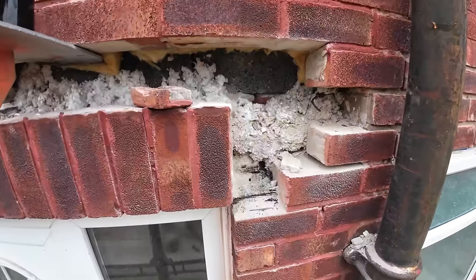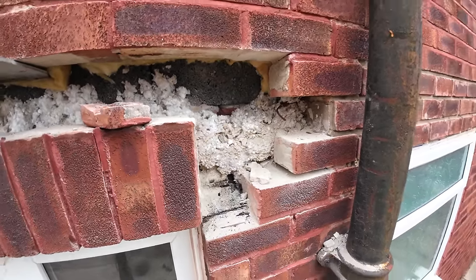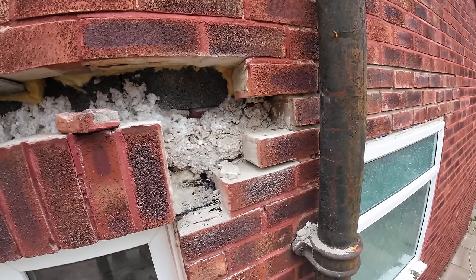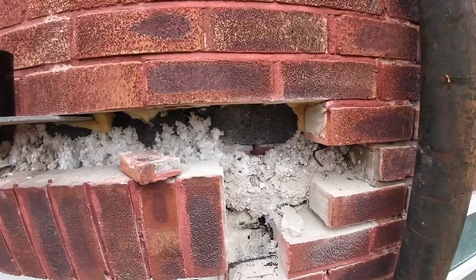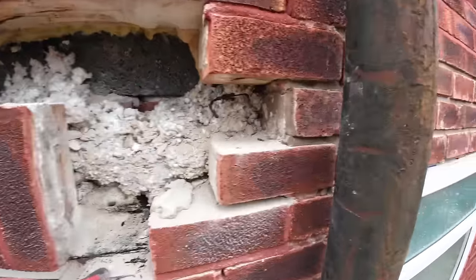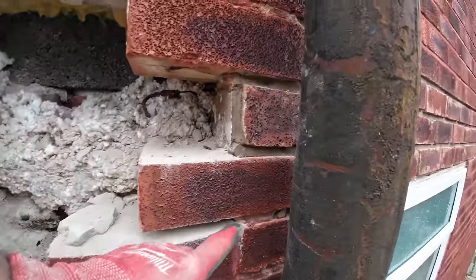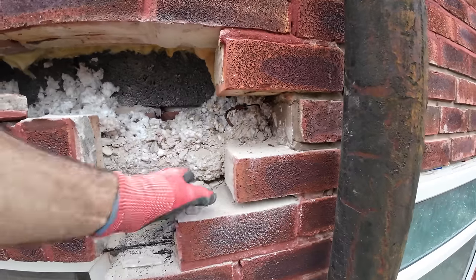So it's a good job we brought two spare bricks, Alex. Yeah. One of those is a three-quarter. They've been cleaned. Leave them up here. I know where they belong in. They've got to go back in the same place. Okay. So there you go. Lintels, of course, low in the window. So we're going to bring our tray up here. There's the vent from the other tray. So our other vent's going to be here. So this brick's got to come out.